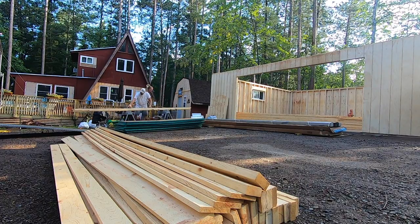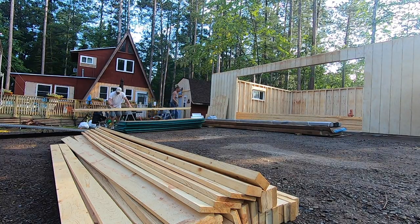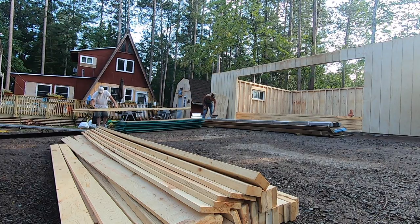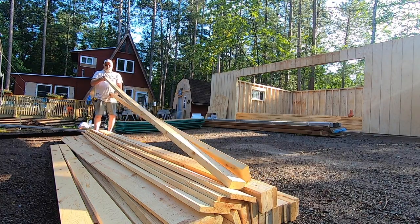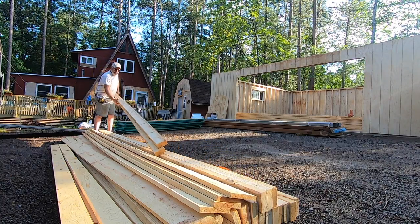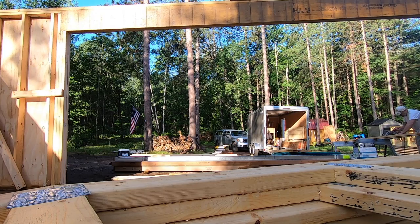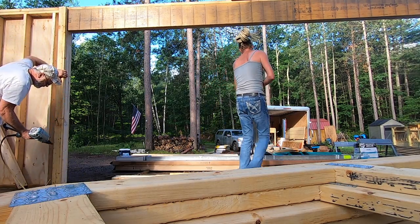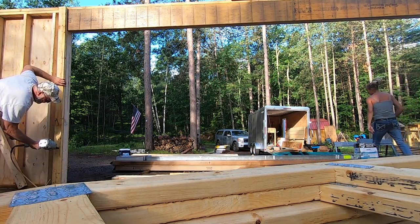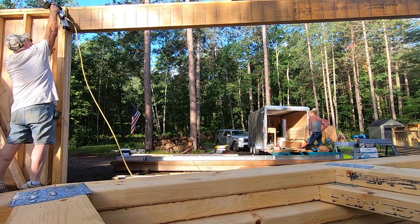With that being said, this garage was started the day before. We unloaded the truck and stood the wall panels, top plated, and set windows in the service door. I next cut the parts for the top half of the roof, including fly rafters, sheeting, rat runs or lateral bracing, and some fascia. The overhead door wrap is usually done the first day, but we left early due to extreme temps and humidity. I'm a Minnesotan and not used to 95 plus degrees.